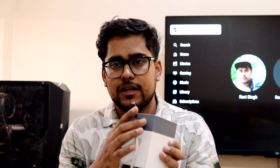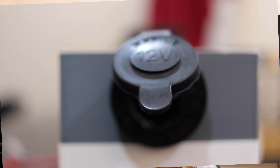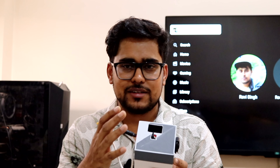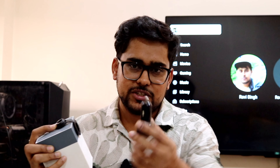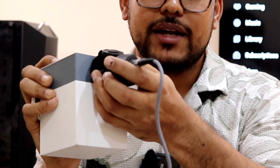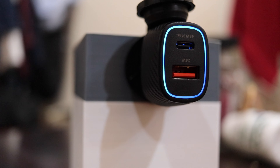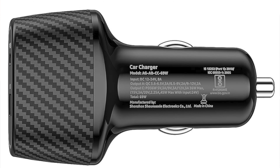This smaller battery pack has a charging connector and a discharging XT60 connector — the XT60 is currently hanging loose because I haven't printed that connector housing yet, but there's a slot where it will fit. There will be a battery indicator on this as well, which I'm waiting to receive. You can connect the cigarette lighter charger to this and charge your devices. It can deliver up to about 30 watts combined from USB 2 and USB-C. If connected to 24 volt, the combined power goes up to 69 watts.